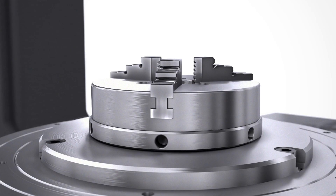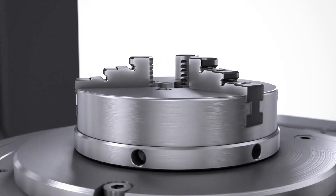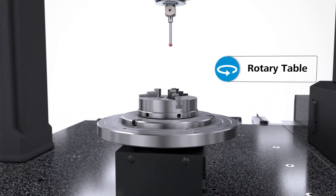Now it also comes with a rotary table — I've just noticed one on this video — does that further advance the capabilities of this product? Exactly. Having the fourth axis added at a machine at this level doesn't impede the accuracy in any way, shape or form. It's a fully integrated rotary table, not just a positioning device — you can use it as a means of bringing the machine into a stationary contact point on the component and rotating the rotary table accordingly. It also has a maximum loading weight of over 100 kilograms.